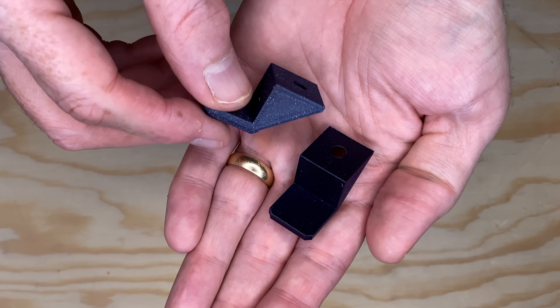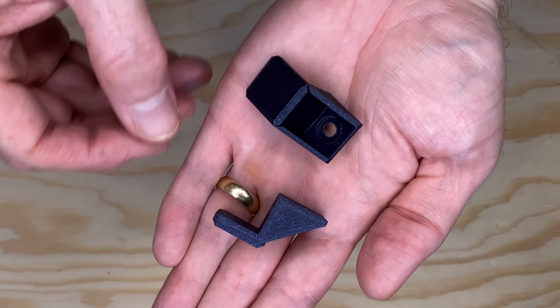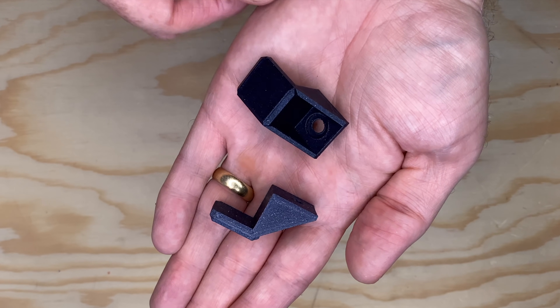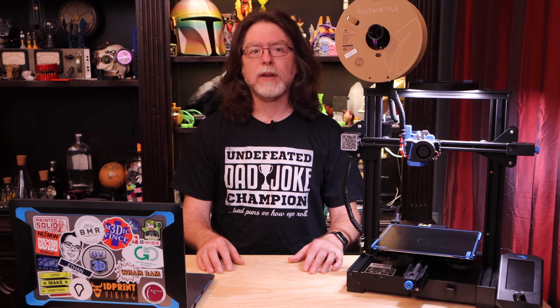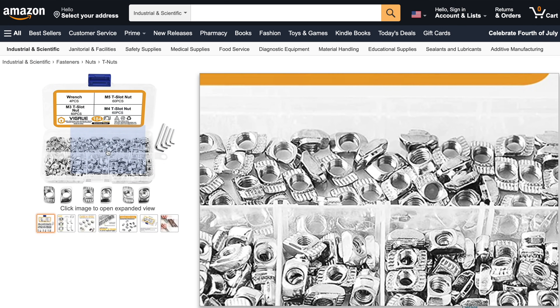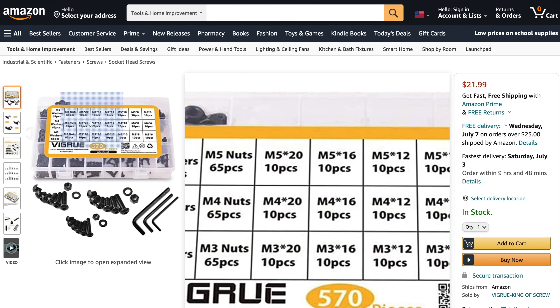The mounting solution is a little 3D-printable clamp that screws down onto the upper 20-20 aluminum extrusion, holding the ring light in place. You need two of them and they take just a few minutes to print. These are the prototypes and they worked the first time, so I'm really happy with them. I designed these to work with a ring light that's about 17 millimeters thick, secured to the printer with M5x8 screws and T-nuts. Many of you may already have screw and T-nut assortments, but if not, I've got links in the description. Since a lot of 3D printed mods rely on these fasteners, buying them means you'll already have what you need for future mods.